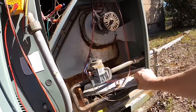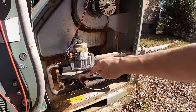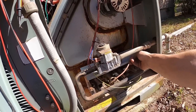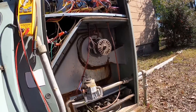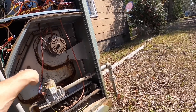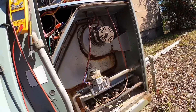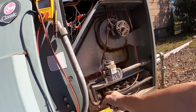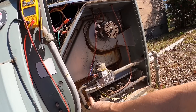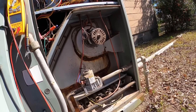That's intact, but I'm not fixing to turn this thing on. They have some expensive repairs here — the heat exchanger. I'm probably gonna quote a new flue box cover, this assembly that we mount our burners to — I need a new one of those. And a thermostat before we can get this going.